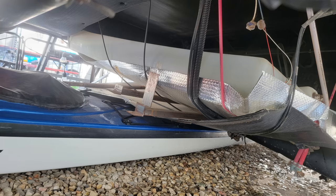So I have a tank that's already full of air, and I'm trying to fill that tank with 50 gallons of fresh water, and there's nowhere for that water and that air to go. So as this tank was filling, it kept expanding and expanding like a balloon until that expansion forced the tank to break the aluminum supports that were holding the tank in, and bam, crashed right down on the ground.